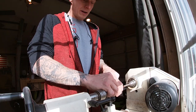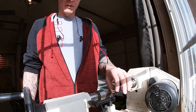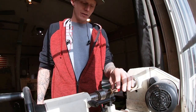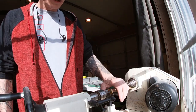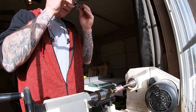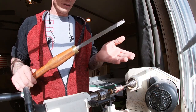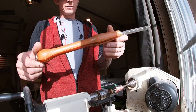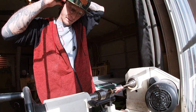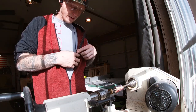Alright, so we've got it all on the lathe. Like I said, every pen kit takes a different size bushing — it gets the outside of the pen to the right diameter so it matches the tip and the mechanism and is flush to the touch. I'm going to be using a Circle Carbide hand-made tool. My father-in-law is a machinist so he made the shaft, and I made the handle. We'll get it to shape and then sand it all down, wet polish it, and go through all the steps.